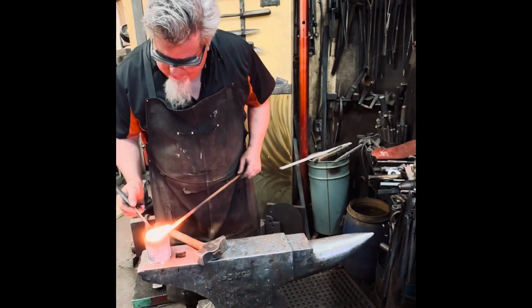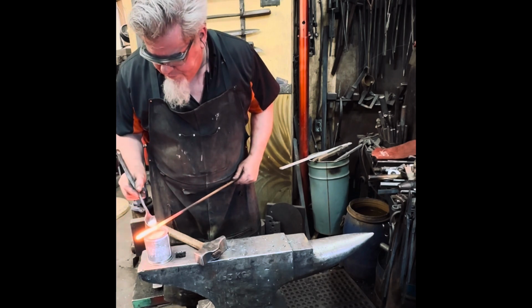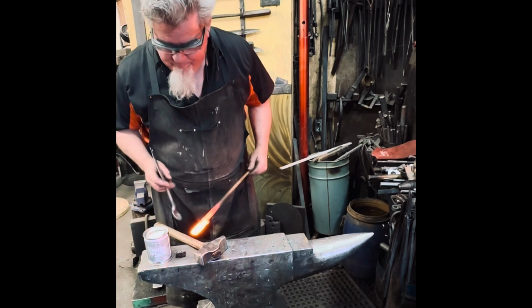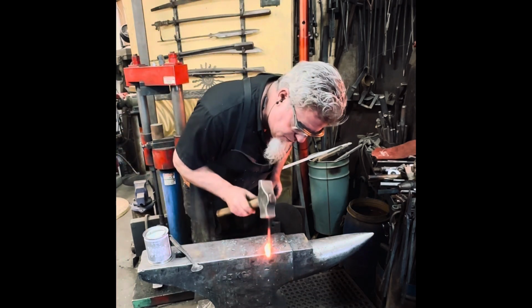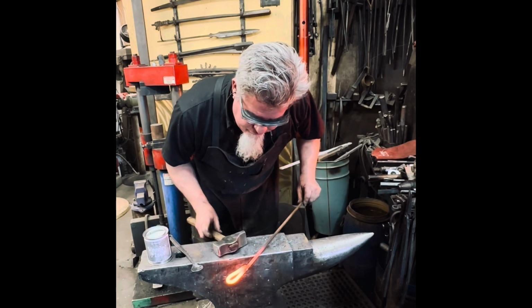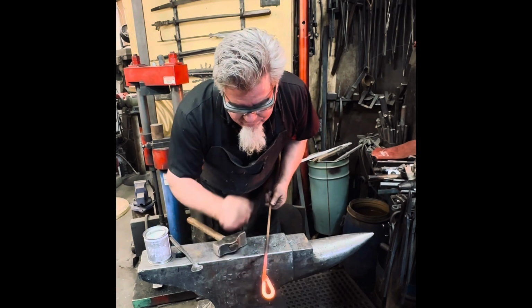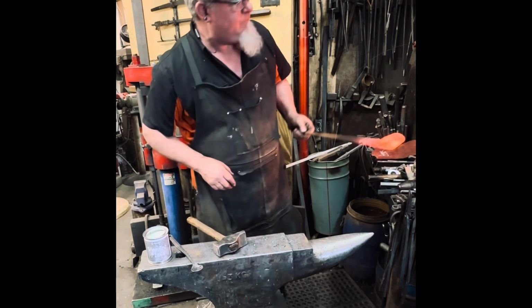There's my joint. I'll apply a little bit to that surface. And then I'm going to hammer gently anyway, to close that void. So now I have complete surface contact there. My flux has gone through from one side to the other. It's molten, it hasn't skipped any parts.